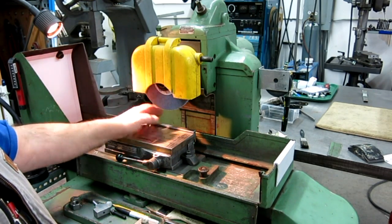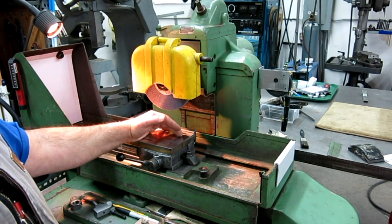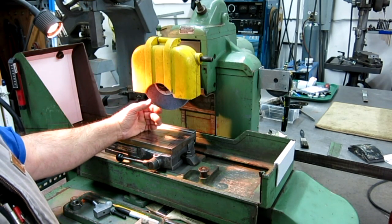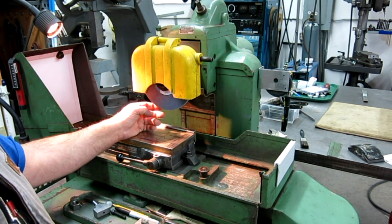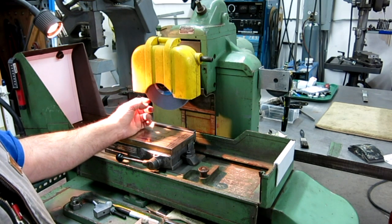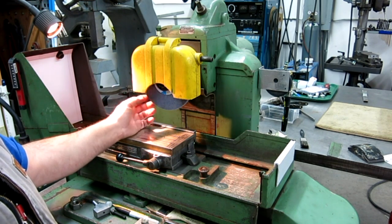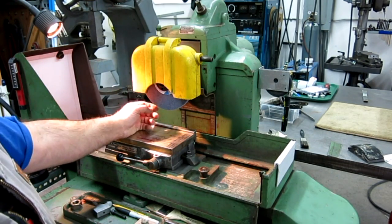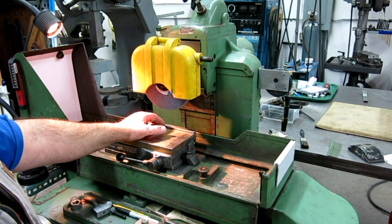In the case of the vise that we were grinding, that was rough grinding. We were plowing that thing pretty hard. This thing's plugged into the wall, so you're converting electrical energy into heat, basically. And noise. So what better way to warm it up than to use it? It's like when you drive your car. You can sit in the driveway for 15 minutes letting it get up to operating temperature, or what most manufacturers say nowadays is just drive slowly for 5 or 10 minutes before full power operation. Which totally makes sense. Once again, it's a mechanical system that you want to bring up to temperature and equilibrium for it to perform.